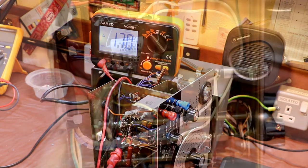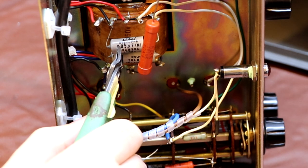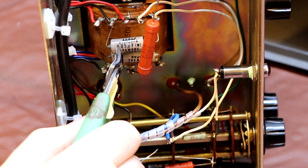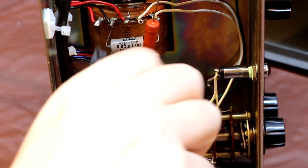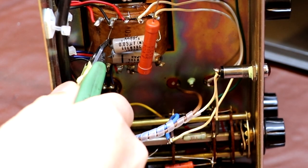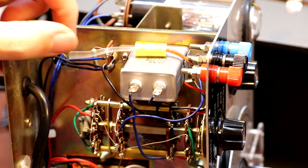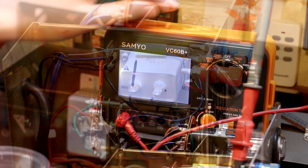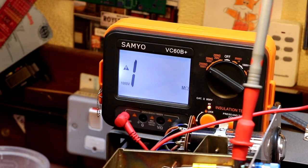Having given this a little bit of consideration, I think the best thing we can do while we wait for the correct Y-type suppression capacitor to arrive is just snip it out for now. Just before I solder the other end of this capacitor on, I did want to show you what a new good capacitor looks like. This capacitor is rated for 1000 volts — let's go to the full 1000 volts. You can see that in terms of resistance it measures infinite — in excess of a gigaohm — so a brand new capacitor does measure nice and high.